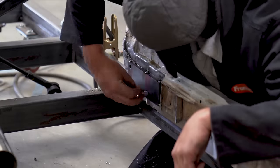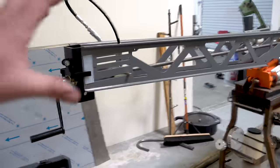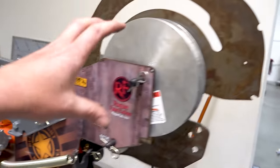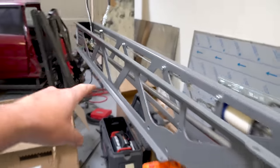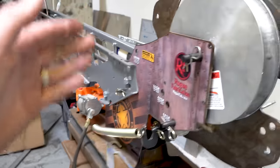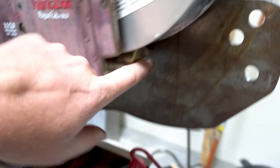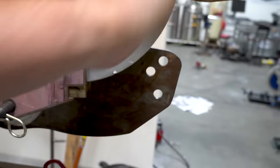This is a little monotonous so I'm only going to show one of the four mounting locations. All of these tubes are inch-and-three-quarter .083 wall chromoly. To bend them I've had to upgrade my Rogue Fab bender — Rogue Fab sent me a mandrel attachment for the back of it. I'm going to use it to bend all of my tubes, and yes, I do have to have it.